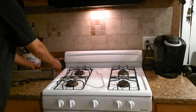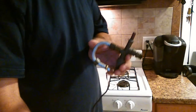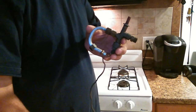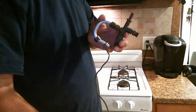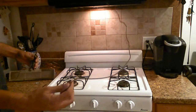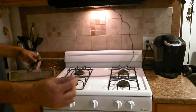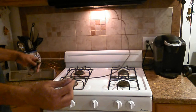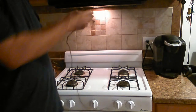I'm going to verify that everything is in safe working condition. I had to set this up with a new one. I have two of these on my barbecue because I have two rotisserie burners on a 48-inch unit. This is an older thermocouple — or pilot generator, which is actually the proper term. I'm going to test the circuit to make sure it's generating electricity from the probe, opening the valve, allowing me to push the plunger down and keep it down when it's lit and hot.